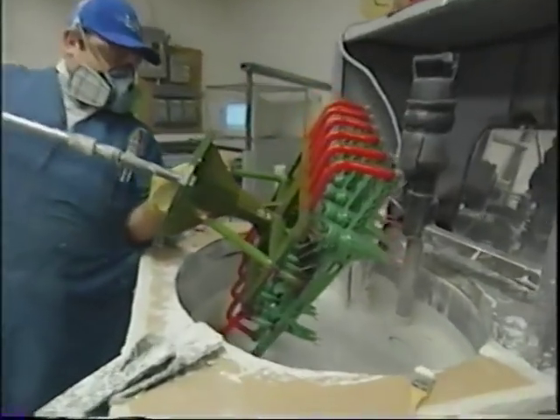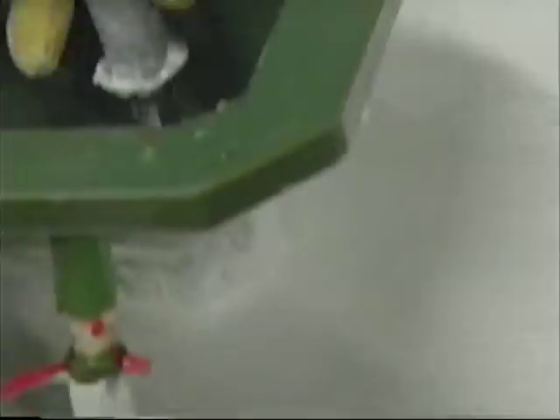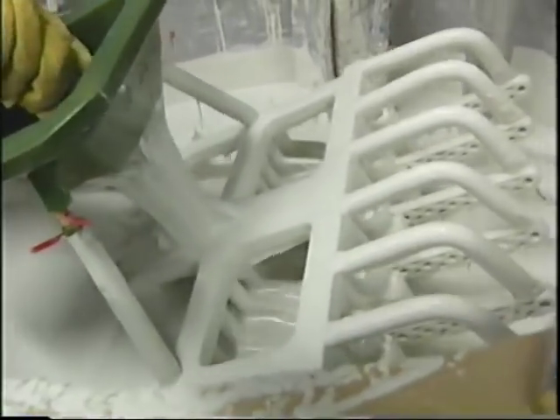The tree of wax hammers then takes a dip in ceramic slurry. "It has to be put on very evenly, very uniformly." After six separate slurry coatings harden up, the next stage begins.